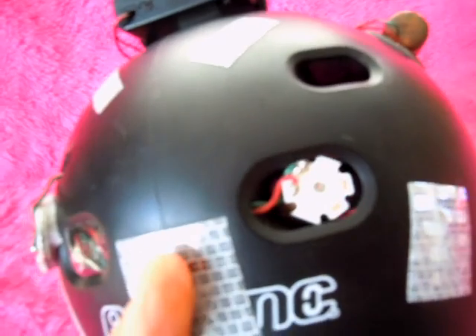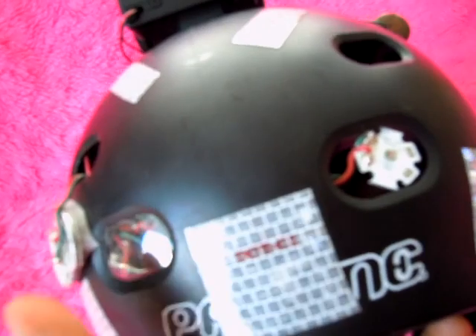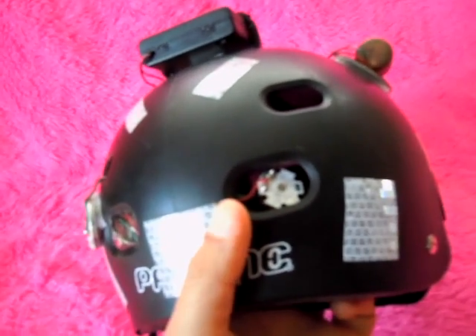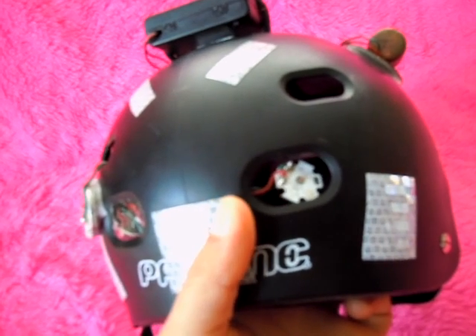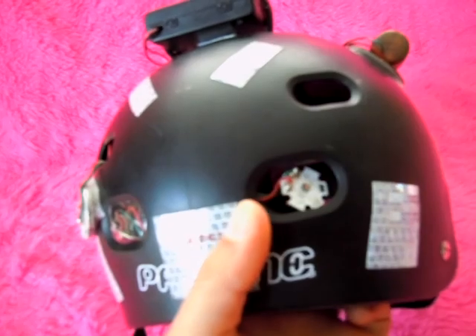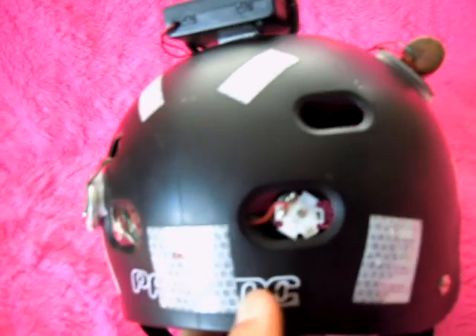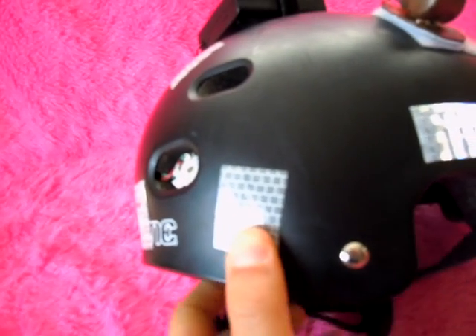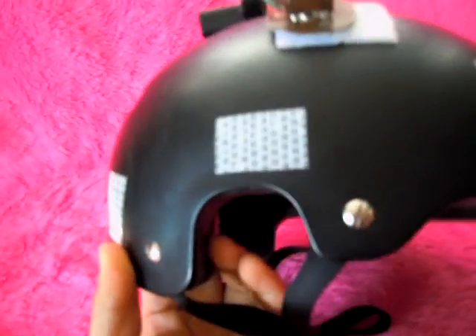You'll notice these are on starboards here. Word to the wise: if and when you get some high-power LEDs, it's a good idea to get them pre-mounted on boards, not just the individual elements themselves. You might risk breaking them — because I broke a whole bunch of them, which is kind of a drag.